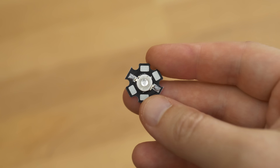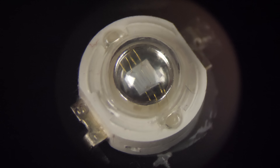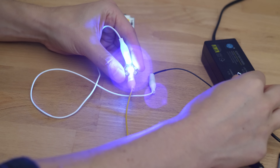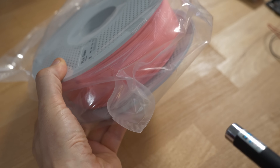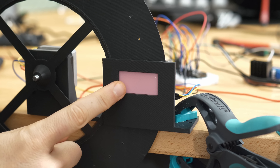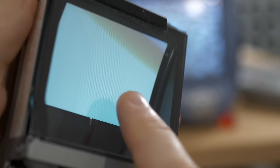Important for the LED is that it's fast switching — LEDs with a phosphor layer are probably not fast enough. On this one you can see there is no diffusing yellow material on top, just a bare die, so this will be fine. I picked a wavelength of 400 nm — that's already ultraviolet and not very pleasant to the eyes, so wear protection if you use them. From my earlier test with the photoreactive PLA, I noticed that high-energy light excites the material really strongly while red light does almost nothing. I'm using the glowing material as a projection screen, so the pixels will persist longer and give us a less flickery image — just like the phosphor layer on CRT TVs.